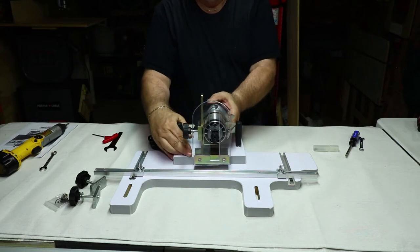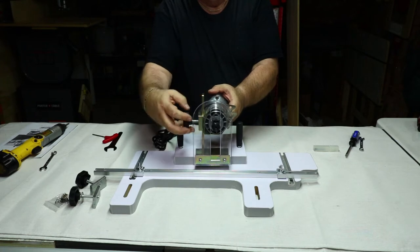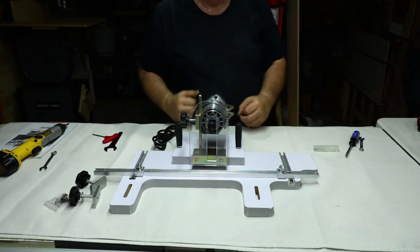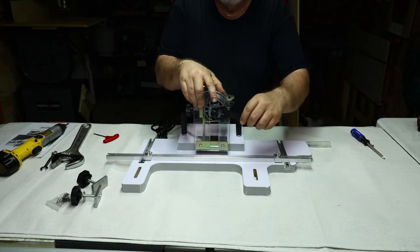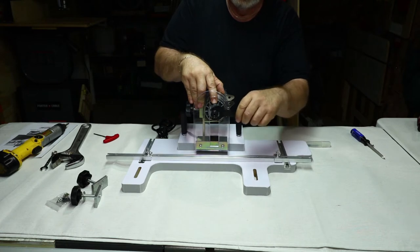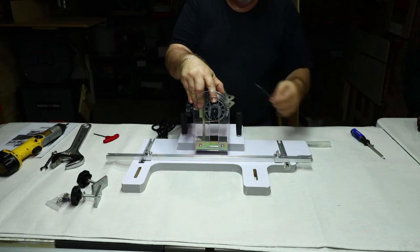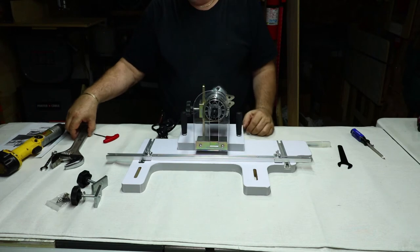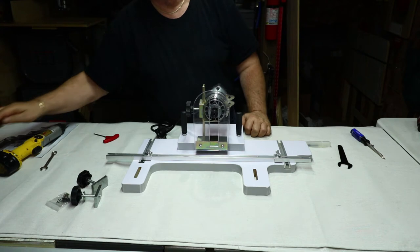You can adjust the height up and down — there are no micro adjustments, but you can use your fingers to get close. Eventually on the lathe, we'll be lining up the tip of the bit with the center of the workpiece. This comes with a wrench for tightening the bit; you push down so the stop nut locks in, then tighten or loosen. You don't have to crank them down real tight, just good and snug.